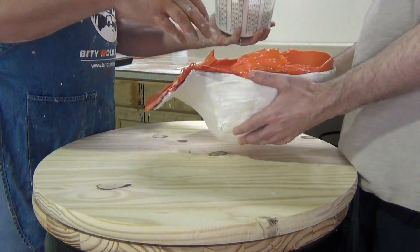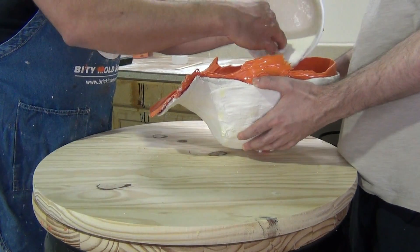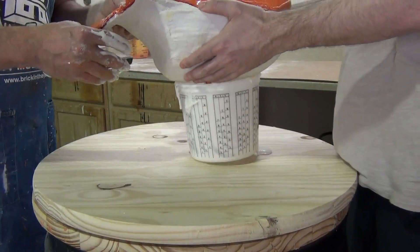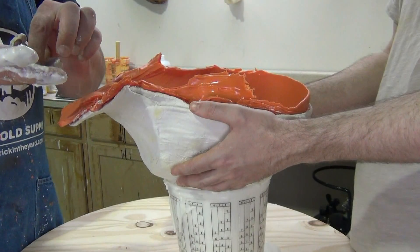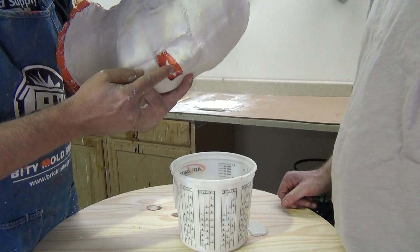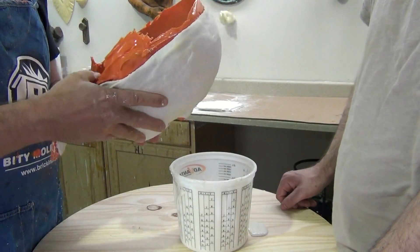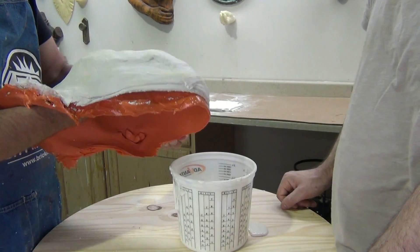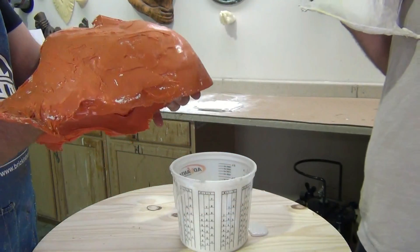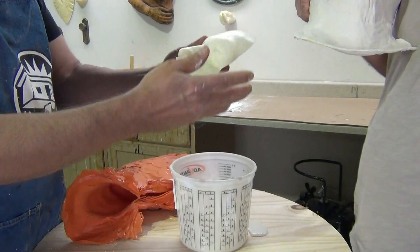What you're doing is having someone hold the mold out — as I'm having John do here — and then you're filling up the inside of the face, pouring a little puddle of alginate. If you have fast setting alginate the intent is that as it starts to leak out, it literally sets up as it's coming out the nose and once it sets up it leaves those little drips hanging out of the nose. This is about four minutes later or so, working in a cold environment, but it's still set up pretty fast. Now you see the little drippies hanging out of John's nose cast — we're going to carefully tear those off, taking care not to pull too much out, and now we're going to pull out that alginate plug, which will give us basically a stopper — a big plug for the inside of John's face — so that we can do our work on the nose without accidentally pushing silicone into the cast.